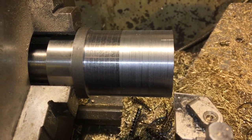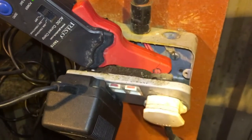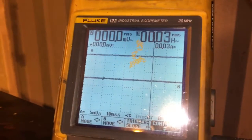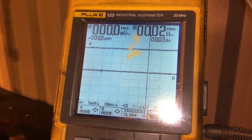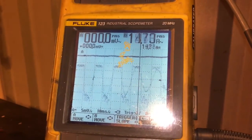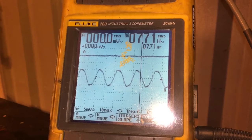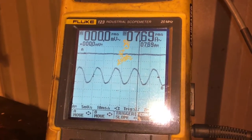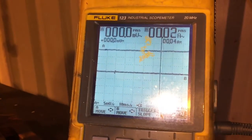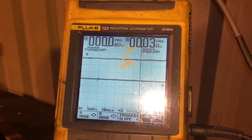One function of the load is going to be the current. Don't try this at home - I've broken into the power supply here with a current clamp and we have a reading on the meter. When the lathe just idles, having run for a few minutes to warm up the headstock lubrication, we're looking at about seven and a bit amps - around 7.6 when the oil gets around it.